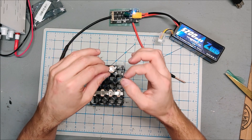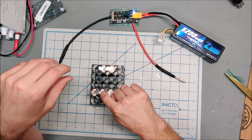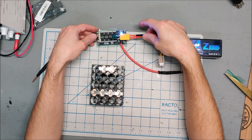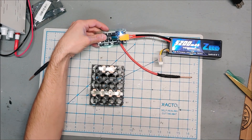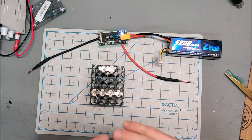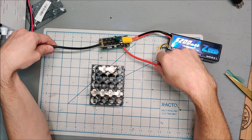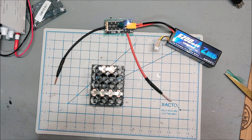The trick is to make sure the needles are in position with good pressure when making contact — you cannot have the needle lightly touching the battery or the spark will jump and cause a burn-through. This new one is every bit as good as my old one. The board does get hot, that's why I put MOSFET coolers on the board. It really comes down to assembling it with good solder and quality needles — these are 10 gauge needles with 8 gauge solid copper tips. This remains my favorite spot welder.